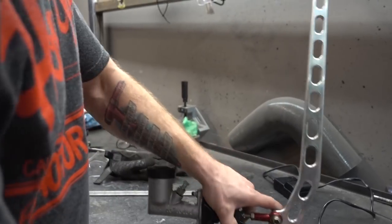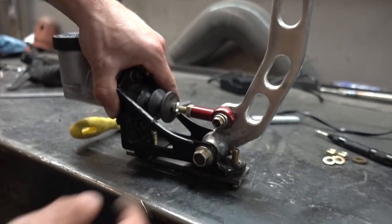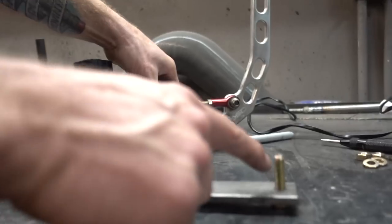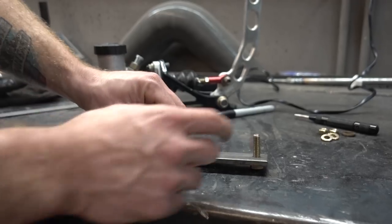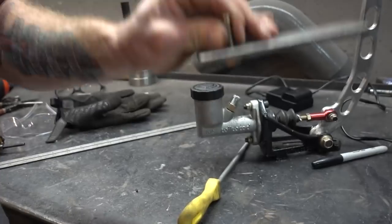This is a really common handbrake setup — the Wilwood master cylinder and bracket with the ASD. A lot of guys use this setup. One thing I want to do is mount it flat. I'm going to have a pretty thick bracket to hold this down, but I won't have room to put it in, so I'm going to weld this to it. To get it to sit flat, they have this powder coat on it and I hate it, so I just grind that off so it sits flush. Then file out the stuff on the inside so it slides in and out — it's aluminum, it's not going to rust. First things first, make sure I drill these holes right.